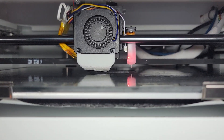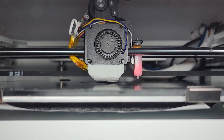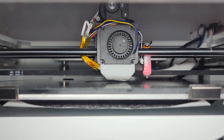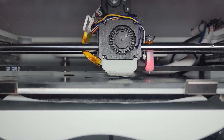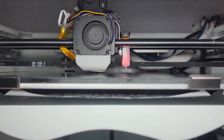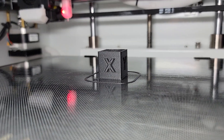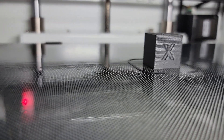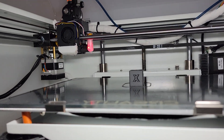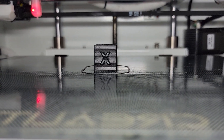I'm using a Raspberry Pi Zero as a secondary MCU to run input shaper, with the ADXL345 plugged in down here. We just have to enable that in Klipper and then start the input shaping. Lastly, make sure you don't forget to do a retraction test. For this extruder they recommend one to one-and-a-half millimeters; I'm starting at 0.5 millimeters and working my way up. Once I find a sweet spot I'll test for speeds, then do a calibration cube to make sure everything looks good. After some input shaping and pressure advance tuning, the calibration cube is coming out quite well — so I think we can call this job done. Thanks for watching, make sure to subscribe, and remember: as always, keep it foul.